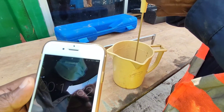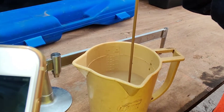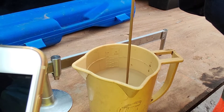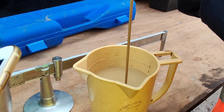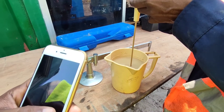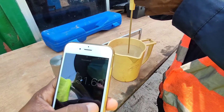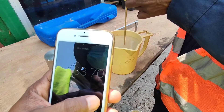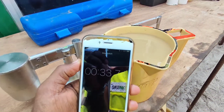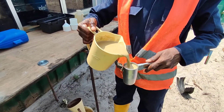The actual name of this viscosity test is the Marsh viscosity test and the capacity of this cup is 946 milliliters. For fresh bentonite, this time should be 30 to 50 seconds; ready for reuse it should be 30 to 60 seconds; before concreting it should be 30 to 50 seconds. As you can see, the cup is filled so we stop the stopwatch — it took approximately 34 seconds, which is within the limit for concreting.